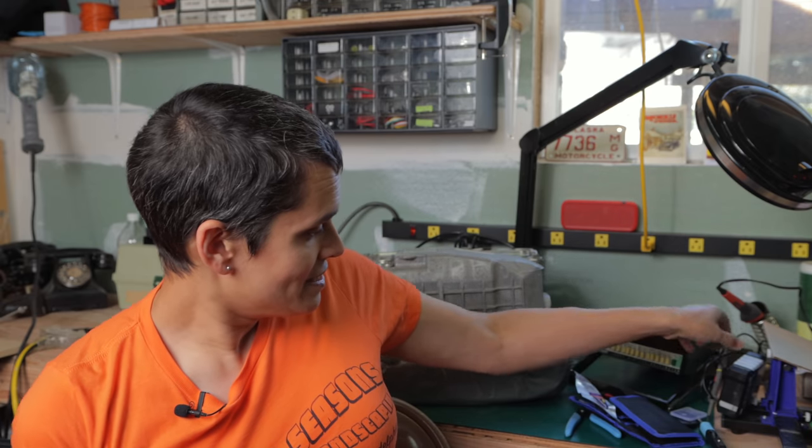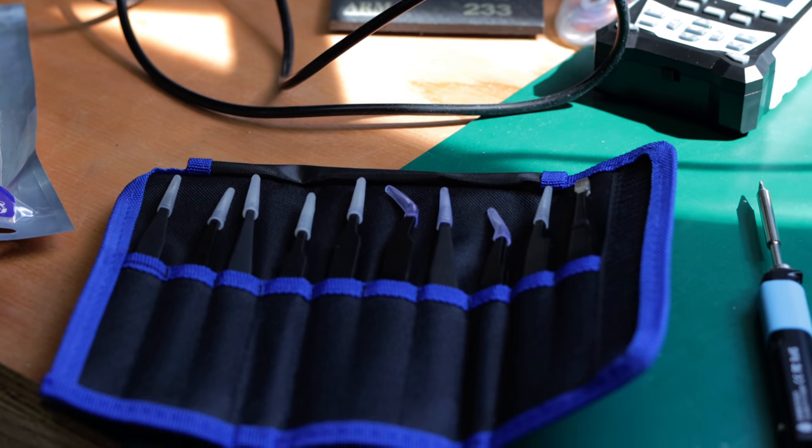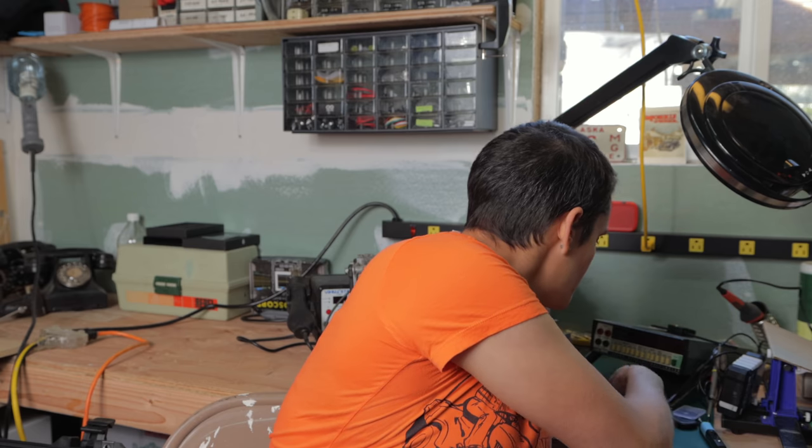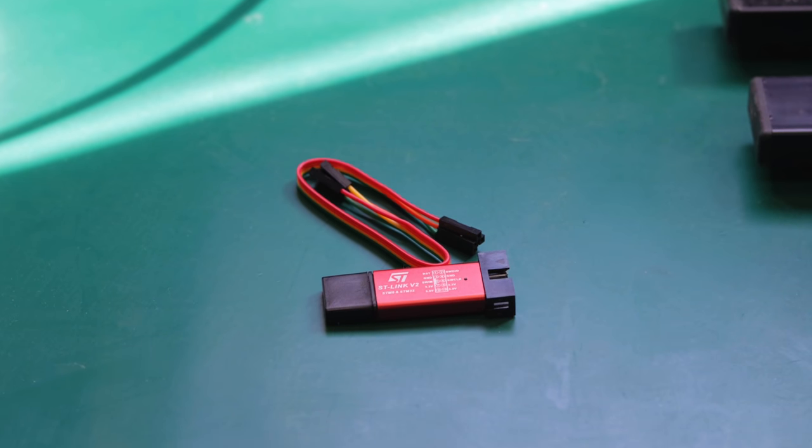I also picked up some tweezers. I learned this lesson because I was trying to repair a Dyson fan which came with all surface mount components. Although it is still very dead, I did work out that positioning surface mount components without tweezers is a nightmare. With the lamp I can see what a mess I've made, but now I can actually put them in the right place in the first place. I also picked up one of these - it's a programmer for the ST microcontroller, which does all the grunt work on the open inverter board. I've never programmed an ST micro programmable chip, so that should be interesting. I've programmed EPROMs back in the eighties on a BBC Micro, so this is a bit different.